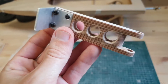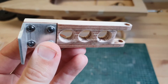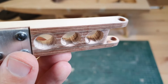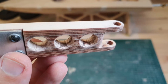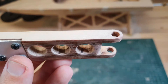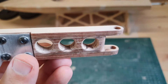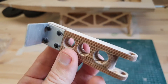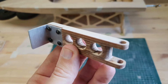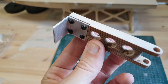As you can see I also put some holes in the rudder bracket — I just like the appearance of it, and also the wood pattern inside the holes. I will glass the inside of these holes to make the rudder bracket stronger. I also made a bracket to attach this rudder assembly to the transom — I made it from an aluminium corner profile.